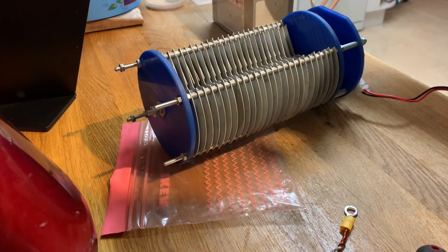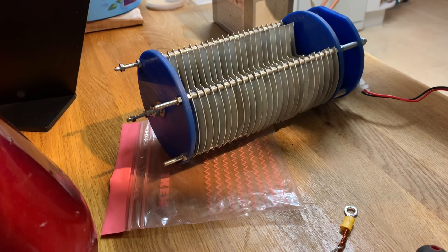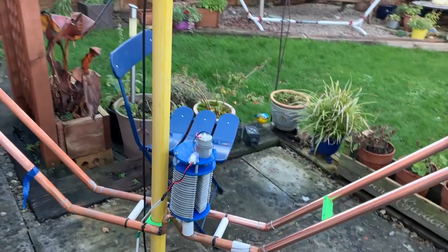Well, the capacitor works really really well. The only downside is that because it's got such a high bandwidth — a lot of capacitance from 10 through to 150 picofarads — the adjustment on it is so fine that it makes it really unusable, to be perfectly honest. The motor I've got only turns at three revolutions per minute, but even that is too fast for the capacitor because of the amount of range it covers. Anyway, so what I've decided to do now is actually the opposite.